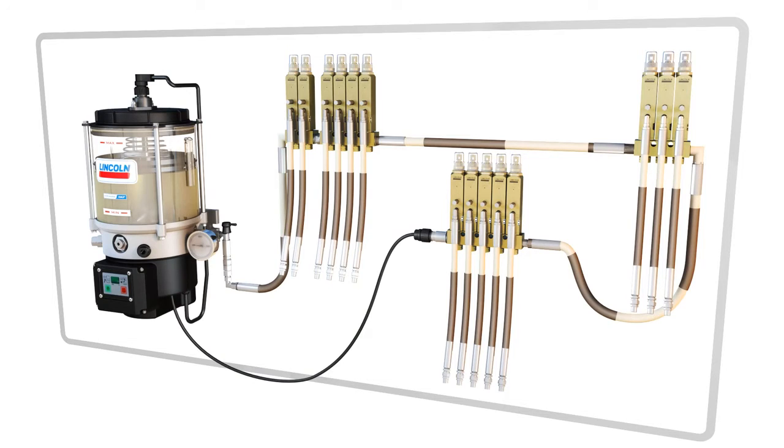Based on the needs of the machine being lubricated, the system will cycle on and off at regular intervals triggered by the controller. In a Centromatic system, each injector can be individually adjusted for the correct amount of lubricant per point. If one injector is damaged, the rest of the system still operates normally.